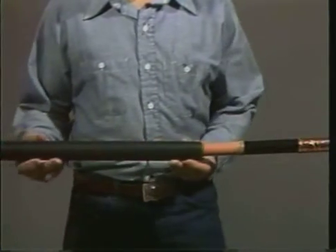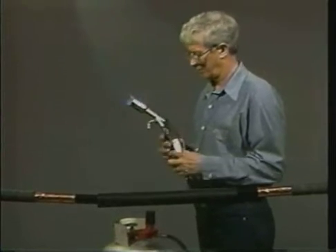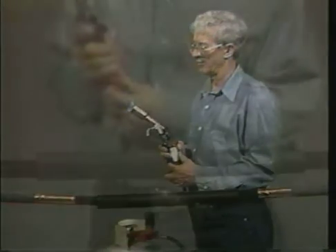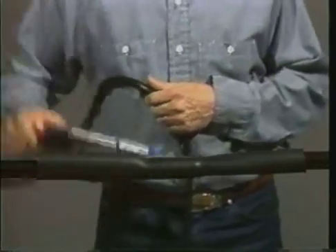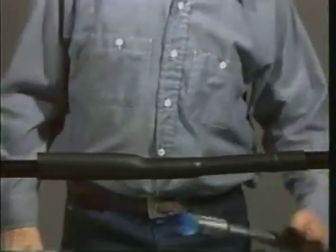After the SRM is correctly applied, slide the black stress control tube over the center of the connector. Then, using an appropriate torch, adjust the flame until it is about twelve inches long. Use the outer three to four inch tip of this flame to heat the tube. Beginning at the center portion, work the torch around the circumference of the tube with a smooth brushing motion. Be sure to heat the entire circumference, including the underside and the back. When the center of the tube has shrunk, slowly begin moving the torch to one end of the tube while holding it at a 45 degree angle. This preheats the tube and forces air out of it to assure a smooth, void-free interface. Once you reach the end of the tube, move the torch to a 90 degree angle and make sure that the tube has shrunk smoothly and has a uniform wall thickness. Repeat this procedure for the other end of the tube.